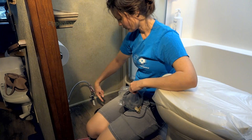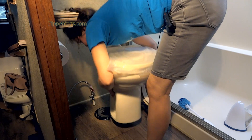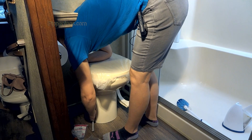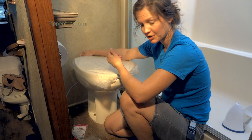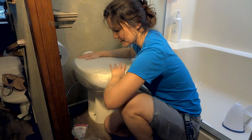So now I can continue with the toilet install. I've got the water pump on, so there's water up to this point — if I open this I can get water actually coming out of here. The toilet comes with one of these guys — that just slips right in there. And now place the toilet. So now I can just tighten my bolts down, and once I get that done, I can connect it back to the water. As you are putting on your toilet, because there's that foam rubber that you put under there, it makes it a little squishy. So as you're tightening the bolts, you kind of want to give it a little bit of a rotation to make sure that the bolts are tightening equally down instead of getting a little bit cattywampus.